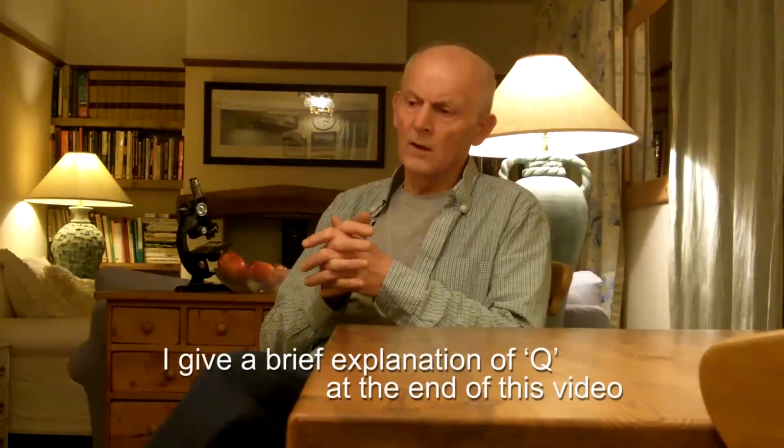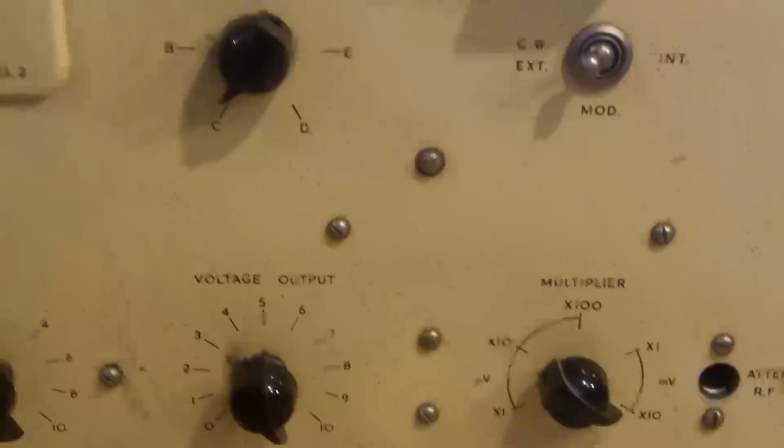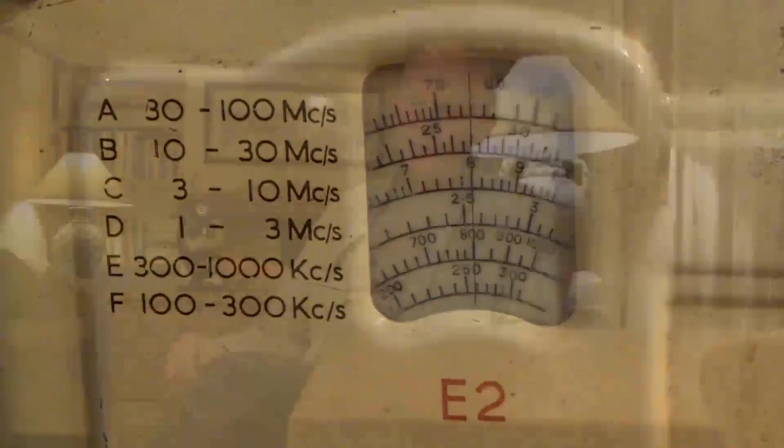And in looking around, I see everybody struggles, and it's really quite obvious why the Q is so desperately low. Not fully sure where I'm going to go with it from here. That signal generator is going to be a very high impedance output, so it doesn't get a lot of drive capability. Whatever I do drive the cell with, it's got to have some capability, some low impedance capability.